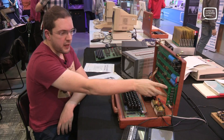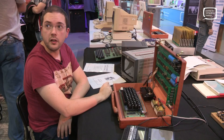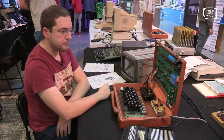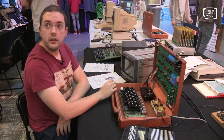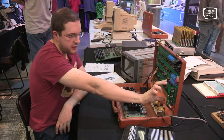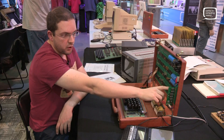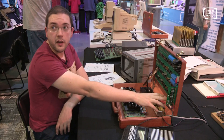You've also got plus 12 volts, minus 12 volts, and minus 5 volts. It's basically a TTL logic board. The RAMs use plus 5 and plus 12, and some of the shift registers for the video display also need the 12 volts. Then on the bottom half of the board, that's your computer section.